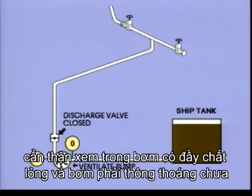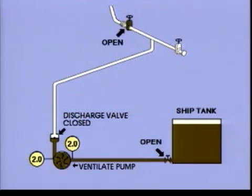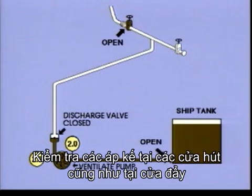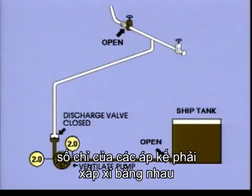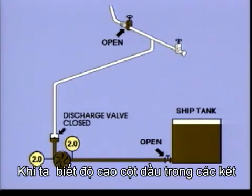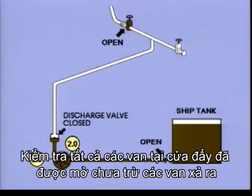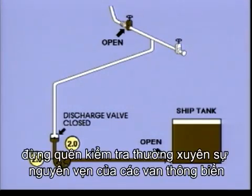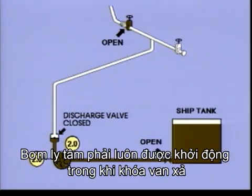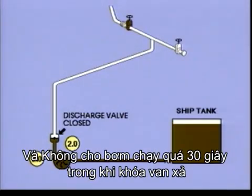Before you start a pump, it should be carefully filled with liquid and ventilated. Make sure that all valves between the tank and the pump are open. Check the suction side manometer as well as the manometer on the pressure side — they should show approximately the same reading. This is the time to do a final check on the accuracy of your instruments. Since you know the columns of oil in the tanks, you can calculate the pressures the manometers are likely to show. Check that all valves at the pressure side are open except the discharge valve. To protect against pollution, don't forget to check frequently the integrity of the sea chest valves. A centrifugal pump should always be started against a closed discharge valve. Never forget this, and don't run the pump for more than 30 seconds against a closed discharge valve.